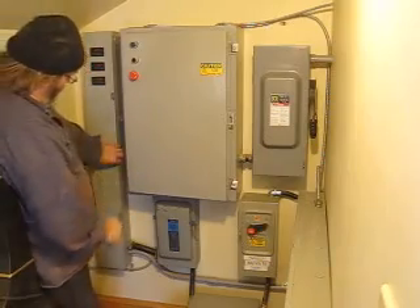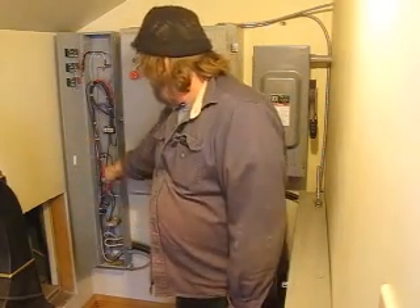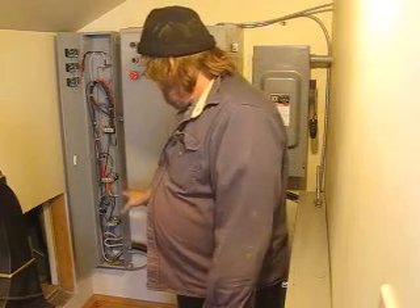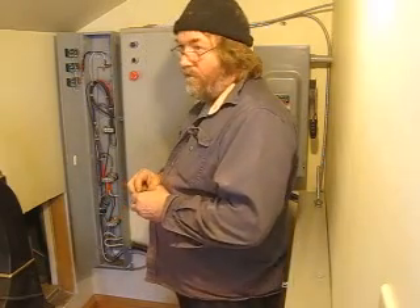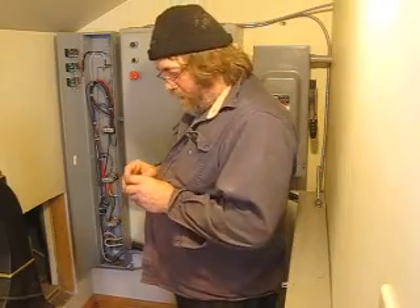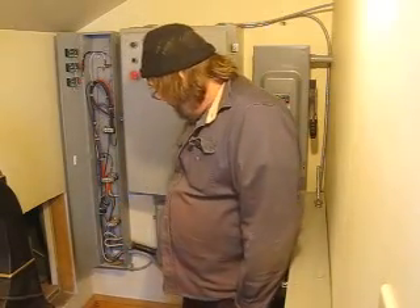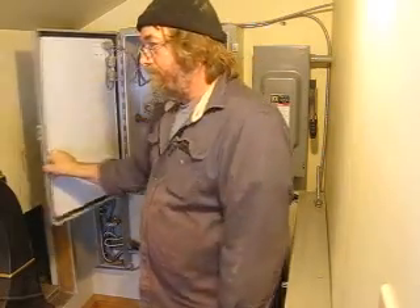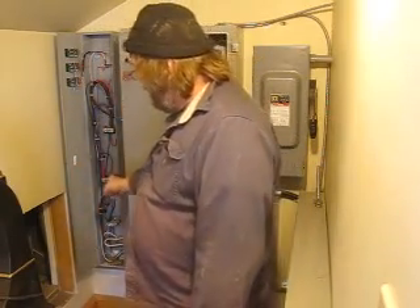From there I go to a 240-volt bus box. These are pretty straightforward — just three connections. For machinery you don't need circuit breakers because the machinery is equipped with overload protection and motor starters — they can be directly wired. Most factories just have disconnects. The two lines go through that starter and liven up two bars: the red and the black.